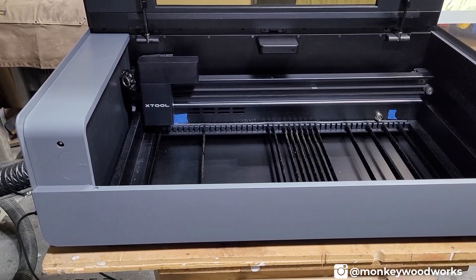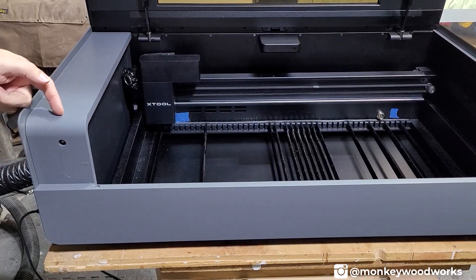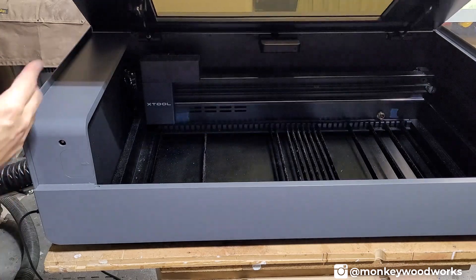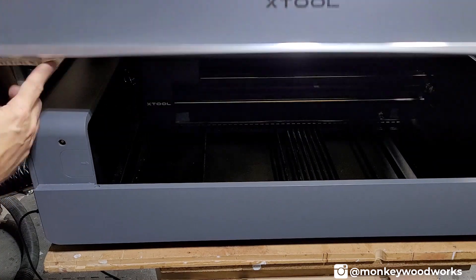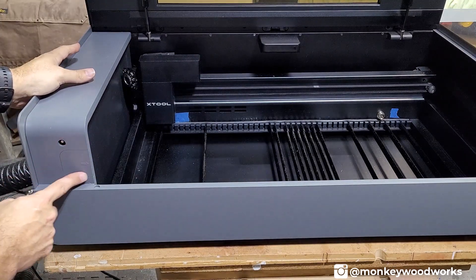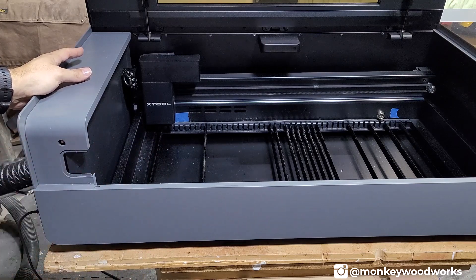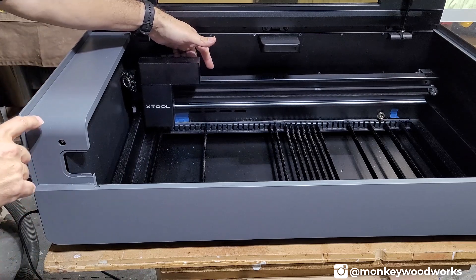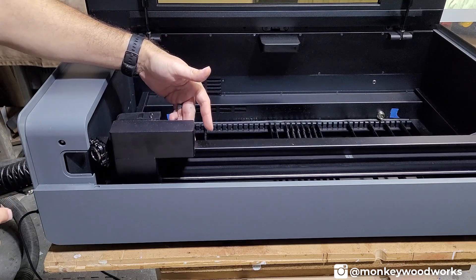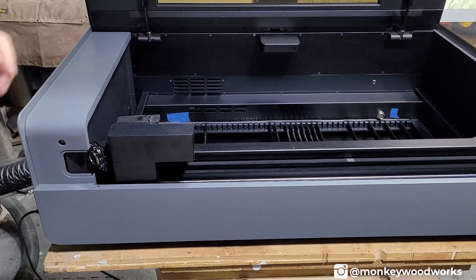Looking at the front of the unit, you'll see a circle right here — that circle has the locking mechanism. There's an actuator back there, and whenever you start up the unit, a pin pops out and catches a hole on the back side of the lid, preventing you from lifting the lid during operation. You'll also see this little horseshoe-shaped piece of plastic. That's there to access the mirror — when you need to change or adjust the mirrors, you slide this forward all the way and it gives you access to make adjustments or remove the mirror.